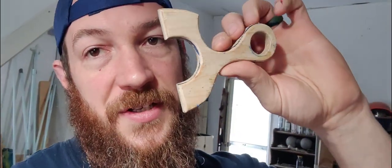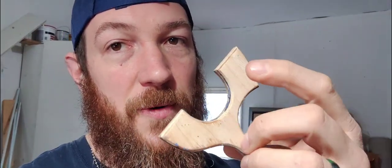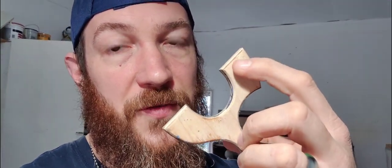I've made a video before showing this, but I did not make the video showing how I make it with the WASP clips. So I'm going to show you how I do that today too. And basically everything else is going to be exactly the same. We're going to trace the template, cut it out on the saw, clean it up on the flush trim bit with the router, hit it with the roundover bit on the router to get all the edges, and then I'll show you guys where we're at as far as making the grooves for the clips